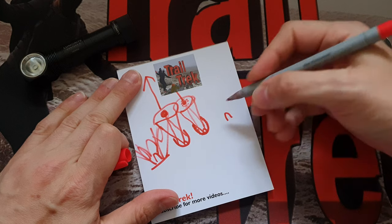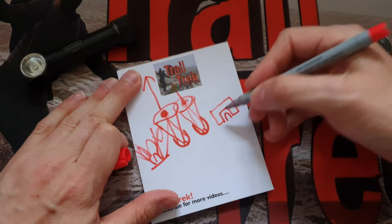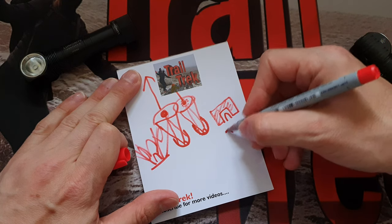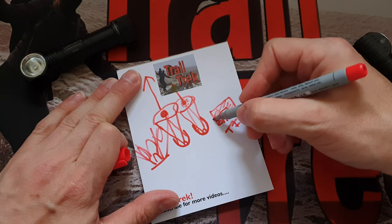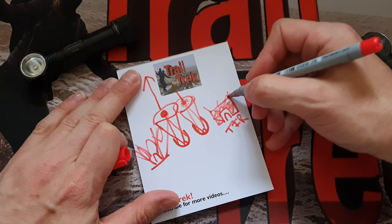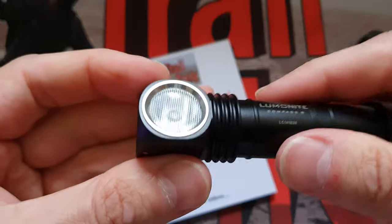The extreme example of up close work is if you use a TIR. So if you have your LED here, and again, this is a cross section, and you place over the top a solid piece of material. Now this is called a TIR, which stands for total internal reflection. In other words, the light is refracted within this medium, and then it leaves as dictated by the design of the TIR. So as you can see on this one, this is Lumintop here.